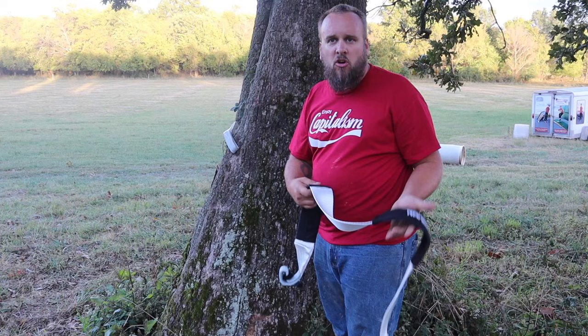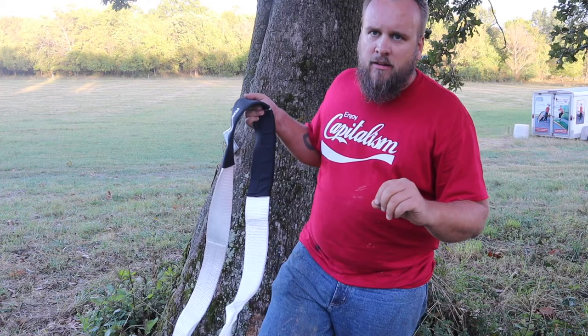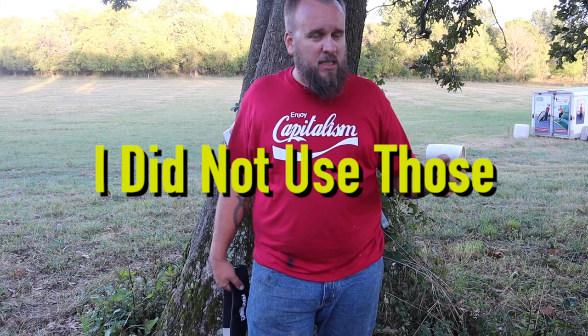And it might seem like these straps could be the weakest link, but these are rated for 30,000 pounds. Whereas I've got some add-a-link and carabiner things that I could use to fasten that chain onto the snatch block, but those are only rated for, you know, 300, 400, 500 pounds sometimes. I even got the heaviest ones that the hardware store had. Those are rated for 1,600 pounds. And they might work or they might not, but we're gonna be having a lot more than 1,600 pounds of pressure on this.